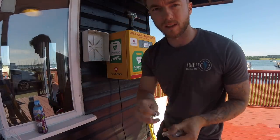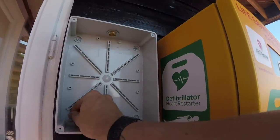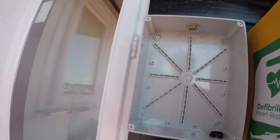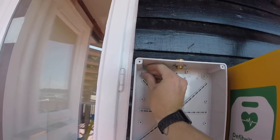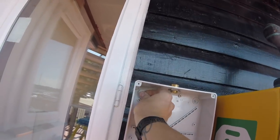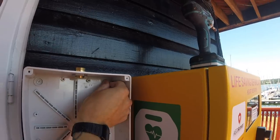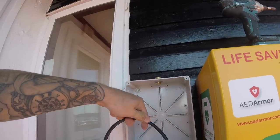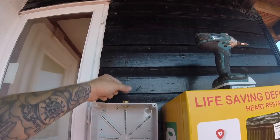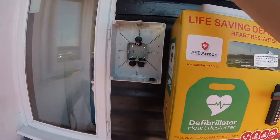This adaptable box comes with nice little screw covers to maintain the IP rating once it's fixed - they just pop into the holes. Now that's mounted I can gland off the SWA cable in there, get the spur mounted inside, and then it's just a case of getting the SWA back to the board and wiring it all up. The box is nice and solid on the wall with the gland in the top for the SWA.